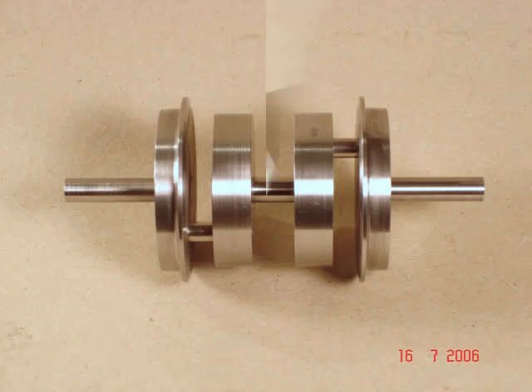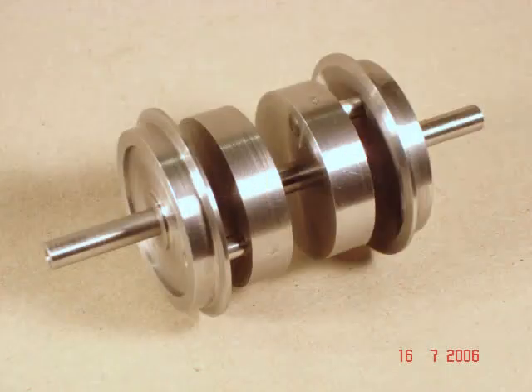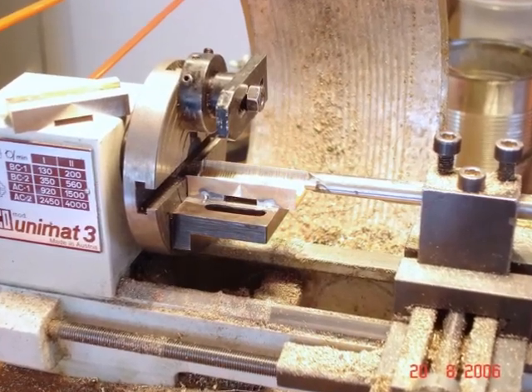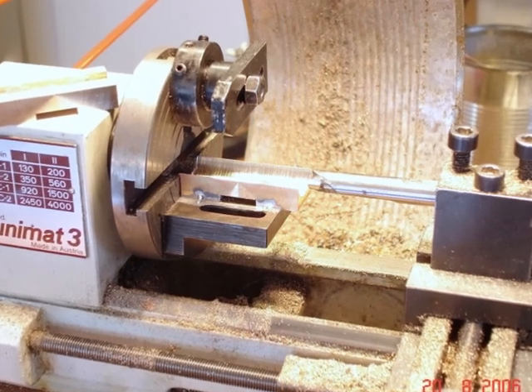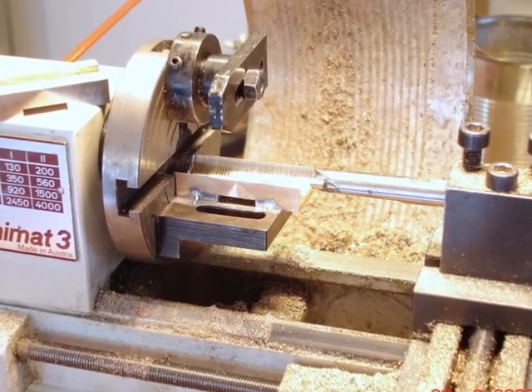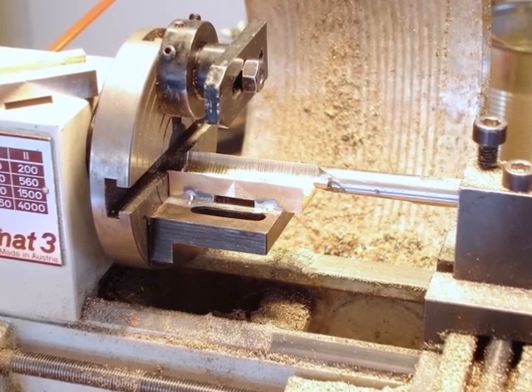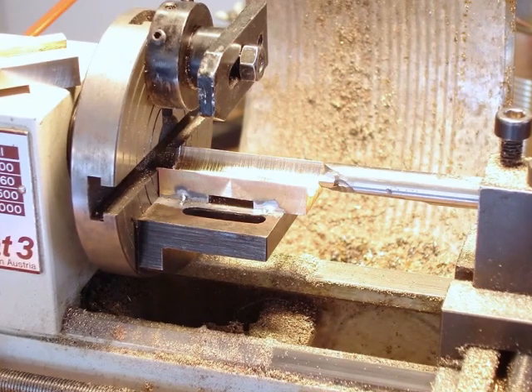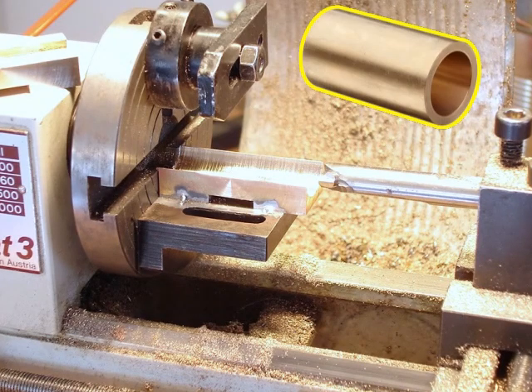This is the longest stroke of any of my engines. I firmly believed that the longer the stroke the better — it certainly worked out well. The axle continued throughout the assembly until after the cranks were glued and pinned, then the excess pieces were hacksawed out and filed to blend. Machining the cylinder port face in the Unimat 3 — it's been soldered to an angle plate and needed a lot of counterbalancing. Using a boring bar to machine the curved surface for the cylinder. Rather than make my own cylinders, I bought in commercial LG-2 gunmetal plain bearings.